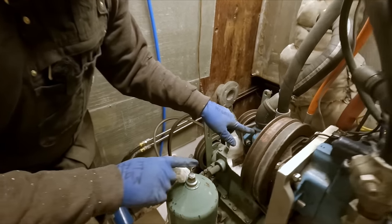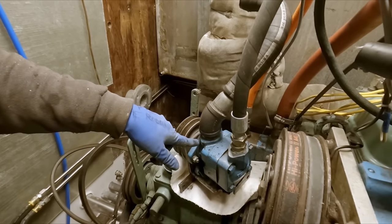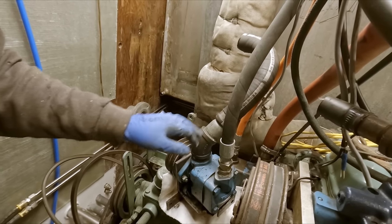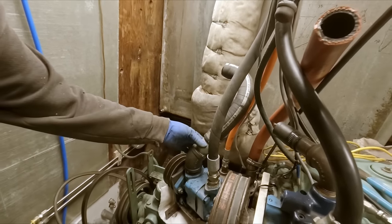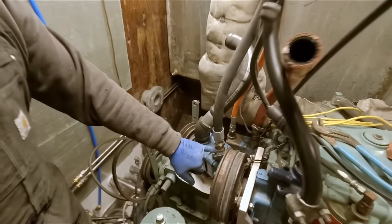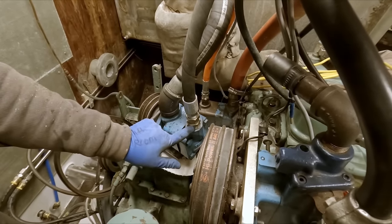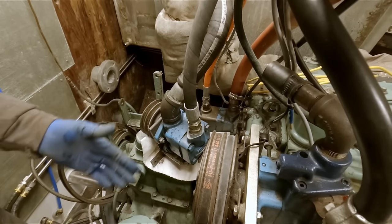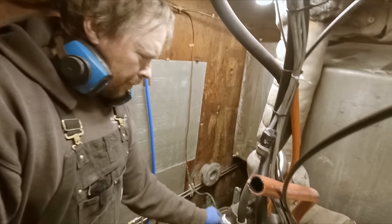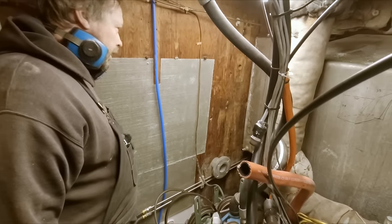Okay, yeah, so you can see these fittings are leaking here. Whenever you're using hydraulics, it's generally not good to just go in there with a nipple like that and then whatever, an elbow. Or even a king nipple. A king nipple, you could at least loosen that and tighten this on the hose. But this configuration, you can't do anything with that if it leaks. The best thing to do is go in with the straight male fitting like this and then a female swivel. So you can crack that, you can tighten up the male, and then you can retighten the female against your fitting or your hose or whatever else you got going on. But this gives you no options whatsoever other than to keep jamming absorbents up against it. And that's never good. That's not a practical solution.